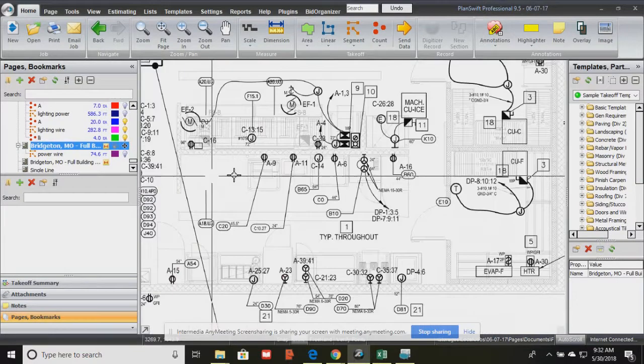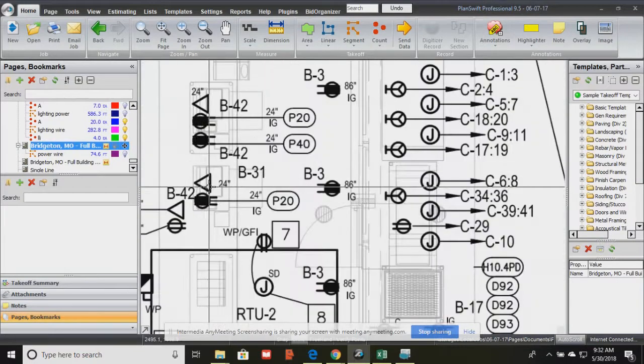Anywhere we see these data triangles, pretty much, that lets the electrician know, because the electrician doesn't supply any telephone outlets, any low voltage wiring for speakers and fire alarm systems and Muzak and HVAC, all of that. That wire, that's considered low voltage wiring. The electrician that does the outlets and lights and stuff, they don't provide that wire.